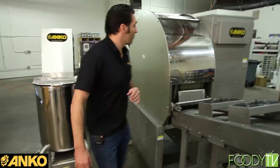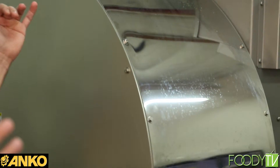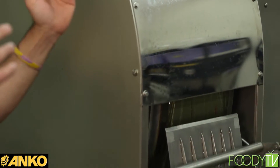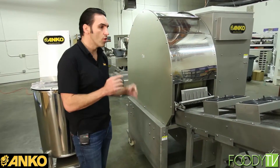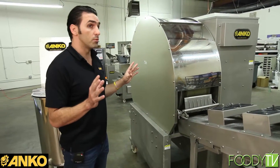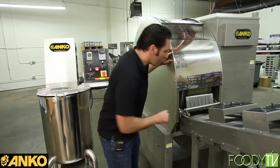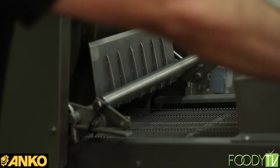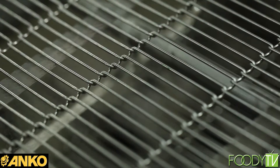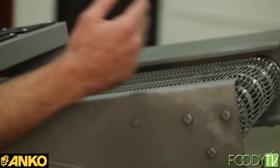The first step is we have a large heating drum — just a big circle heated on the inside. As the liquid comes up onto the drum, it's going to cook it, just enough. All of this, as I'll show you in a minute, is totally programmable. The pastry is going to come up, and we have a blade here which takes the pastry off in a continuous film. We put it onto the conveyor, which is open, allowing it to cool down. At this point the pastry comes off the line cooled, and then we go into the cutting process.